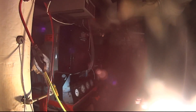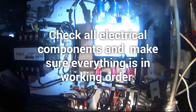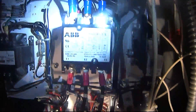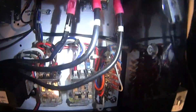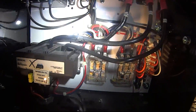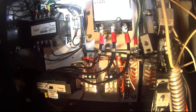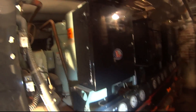I don't remember which one was the compressor that was grounded — which one? Number four, and one and two. Check all the wires, make sure nothing's burnt, nothing's cooked — no french fries. That's all you do — you just want to make sure everything is in working order. Check all the contactors and relays — you pretty much go through all of them.